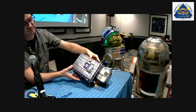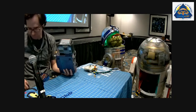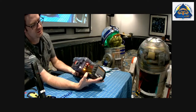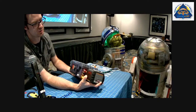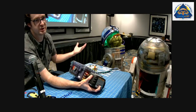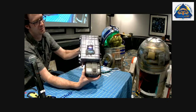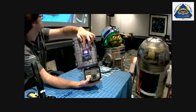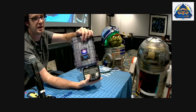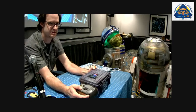So I guess on the outside first, I turned it off. We've got power, which I probably need a beefier power switch, and motor controls, so I can cut those off if I want to push it so I don't regen power in, or just for troubleshooting. And then I've got my battery monitor, and a temperature sensor. If it gets up another 2 degrees, the fan will kick on and try to keep everything cool in there, because I was worried about ventilation and heating being inside of an enclosure.